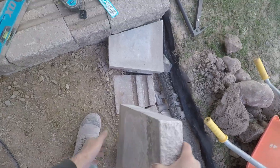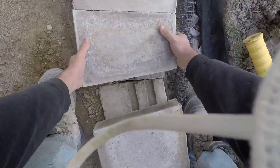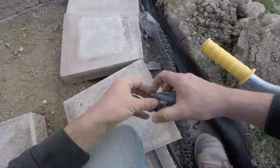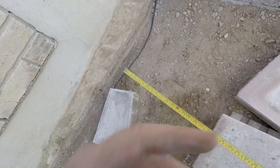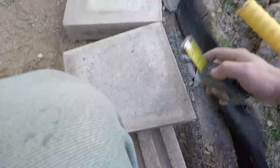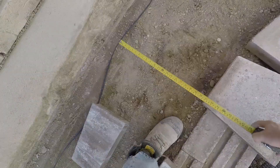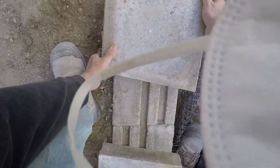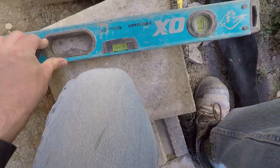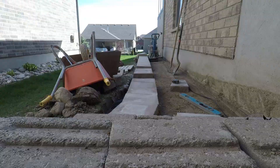One last time I can measure those distances, making sure that they're equal. Cut it, bring it back, and then we've got a nice piece to place. We can go ahead and continue placing pieces or just continuing this process — it looks like here we have one more piece that we need, and it's the final piece. So I'll actually measure the overhang as well as the measurement from the foundation to the back of this cap, both times making sure it's equal and parallel to that foundation. Then I can go ahead and draw my line — this is gonna give me the perfect amount to place the remainder of my caps along this run.